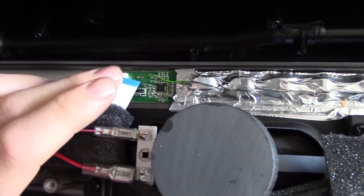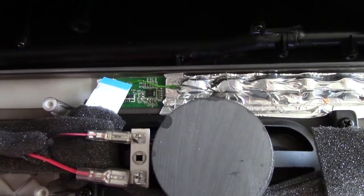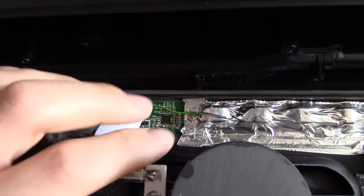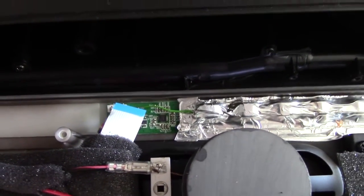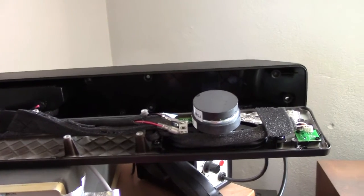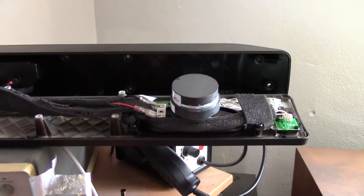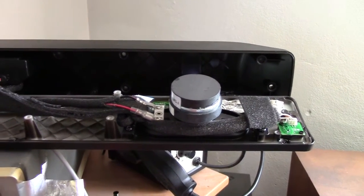There isn't a whole lot of stuff going on there. Behind this screen we've just got some LEDs and capacitive touch buttons, so it's basically just PCB. Although we do have these capacitive coupling devices there, I'm assuming, I'm no expert in capacitive touch buttons, but they should have something to do with the buttons, since they're just connected to traces giving a number there. So what I'm thinking is that I'll actually remove a couple of them and see, or rather just poke around first in order to determine which components are connected to what, and try and disconnect the source button, since that seems to be the only one that's actually acting up.